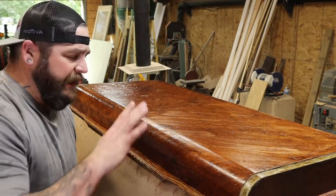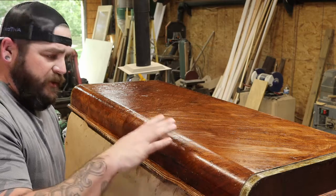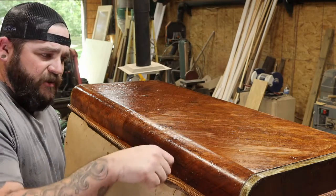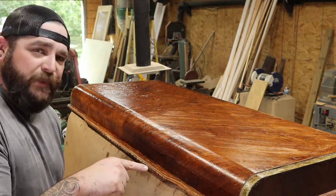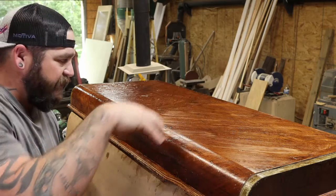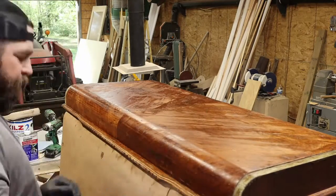I've gotten a good solid wet coat of the stripper onto the lid and I'm going to let it set for about 20 minutes, then come back and start scraping. I've already scraped a little bit on this dental mold piece and that's really time consuming, so hopefully the top will start lifting that old finish a bit faster so I can scrape these large areas off quickly.